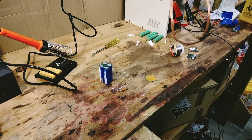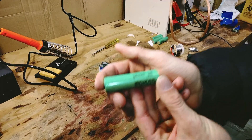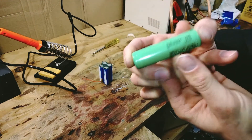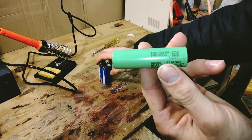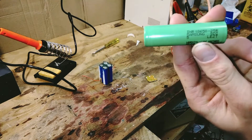What I'm going to do is arrange our new cells, which are Samsung INR 18650 25R cells — power cells made by Samsung. These are actually slightly higher in capacity: 2500 milliamp hours versus 2200 like the old battery. So this will be an upgrade overall — they're just good cells.